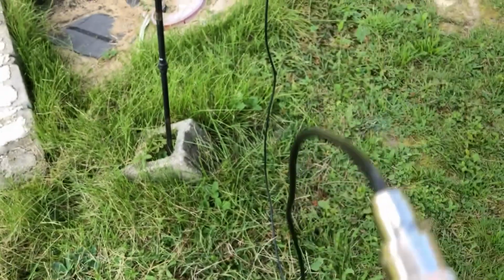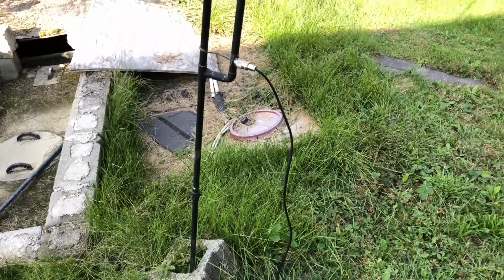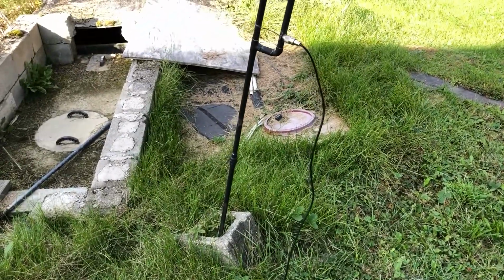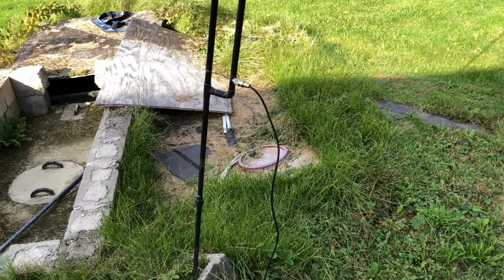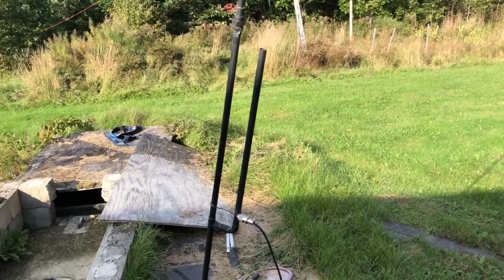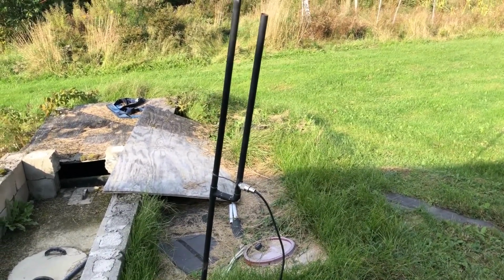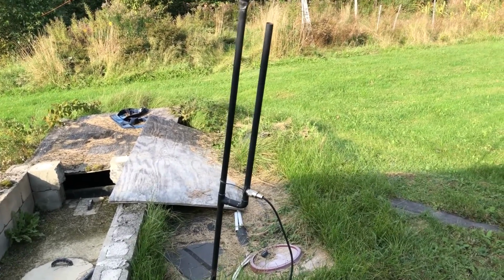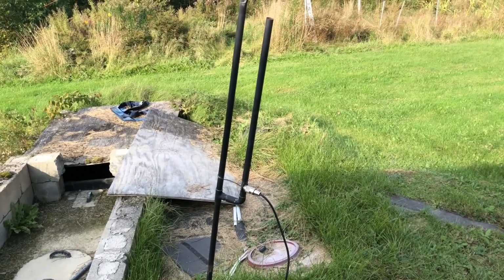There's my off button. So there's 3 different spots. One's touching metal, one's sitting right on the ground, the other one's touching metal on the ground, and then the other one's jammed in the wood pile, and there's the SWR across the band. You don't have great elevation, but the antenna will work at those elevations. You'll get some local coverage out of it, maybe you'll get some repeaters out of it for the low cost of whatever you can find some copper pipe and some fittings for.